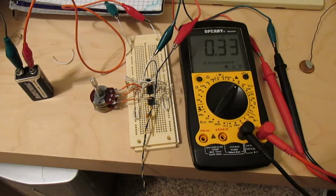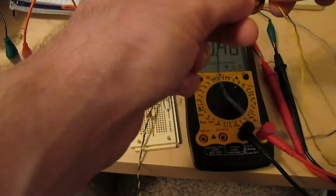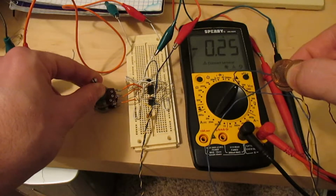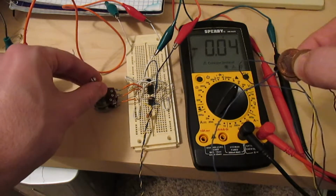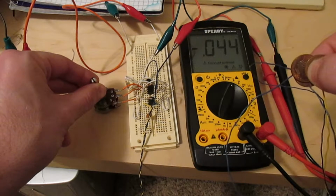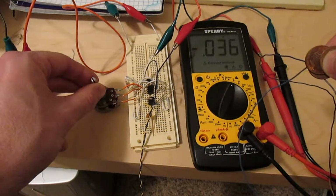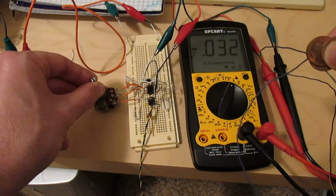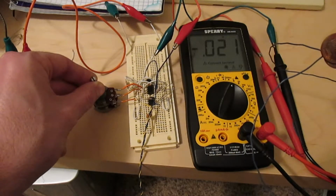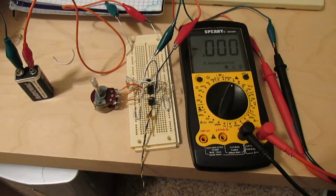Alright, so now what I'm going to do is take all the electrodes and connect them together. So I should have 0 volts at the input. And then I can adjust this knob to go to 0. Alright, let's turn this bit. And so once I have this set to 0, that will have calibrated out all the impairments of the op amps. And then when I put these pennies all up on my chest, any DC offset I read will be coming only from the electrodes. Now I attach all these pennies to me and look at the DC offset.